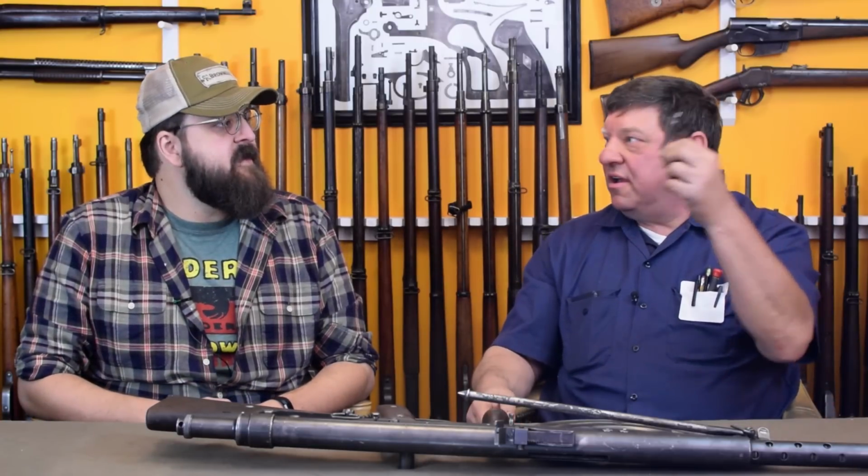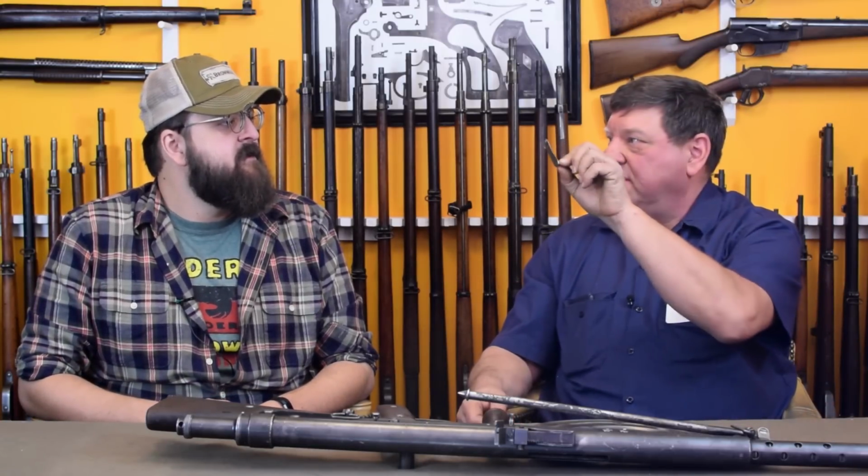That's wild. To be fair, you said the Prussian blue was in there. Maybe somebody just got in there and tweaked the finish. But no, all those parts are moving so much. There's so much friction in that system. Someone was trying to figure out why the gun didn't work, and it didn't occur to them that all the parts weren't there, and that's exactly why all the Prussian blue was on it. They're going nuts trying to find something that wasn't there. I had to put some metal back inside the gun in order to make it work right. I had to re-add some metal in some spots. I believe it. A little judicious TIG welding.